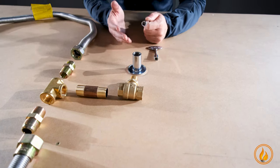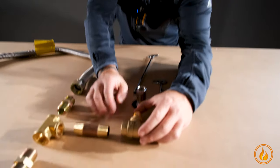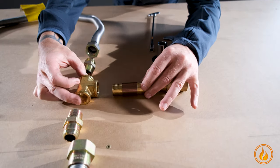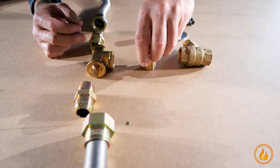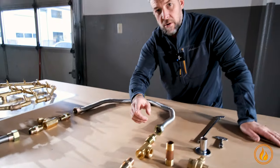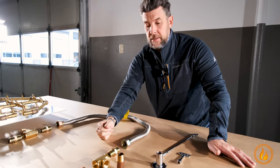So next in a dual flex line kit is going to be this 3/4-inch nipple. You have 3/4 in, 3/4 out, straight fittings. This fitting is provided into a T. Those T's are going into the respective 36-inch, 3/4-inch stainless steel, whistle-free flex lines.